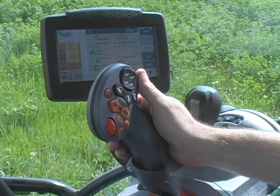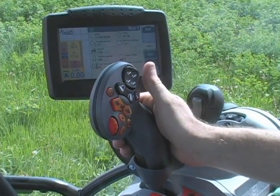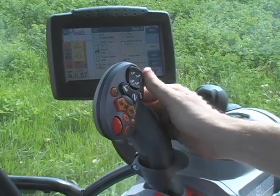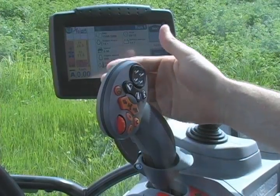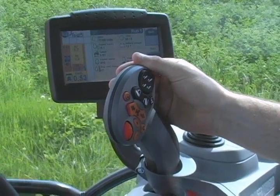The third method of controlling the tractor's direction is with the command grip handle itself. You simply use the handle to move the tractor forward. When you want to switch direction, bring the tractor to a stop by pulling the handle backward. Once stopped, return the handle to neutral and pull backwards, and the tractor will move in a rearward direction.